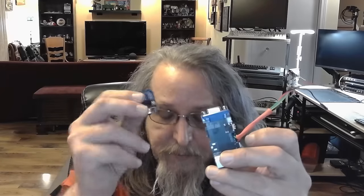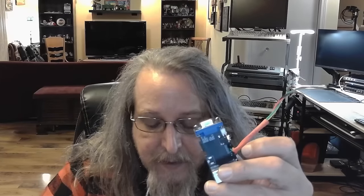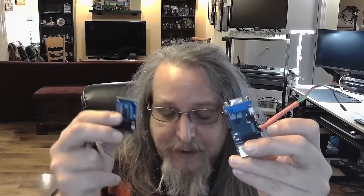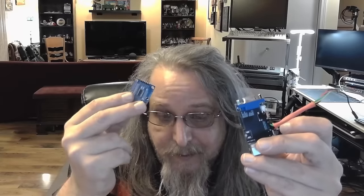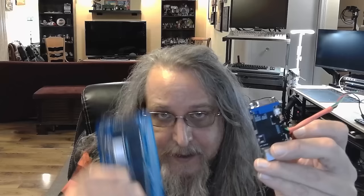So I'm going to walk through how I built these. I have two of them: a TTL version and an RS-232 version. I will add some of the options for additional things, like flow control, which you can add. Some of these little TTL adapters don't have the RTS and CTS signals pulled through. Other ones do. And I'll show how I can connect to various stuff. In fact, another one is you could use this to get a serial port off a Raspberry Pi and get a console on there. So I'll show that as well.